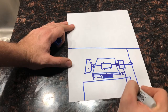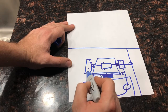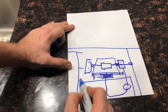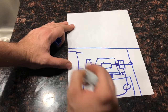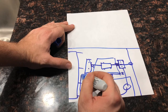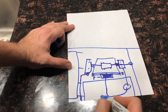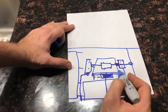This one, I dropped the wires down, went back up to where everything's supposed to be. This one I had to drill through because there's a pocket door here, and they have all the bracing. Typically for me, that's how much bracing I put in so that this framing doesn't move. So I had to drill through that one, through this one, to go over and meet up to where the hole was, and then come down, go across, and up again. So then you have your three speakers.